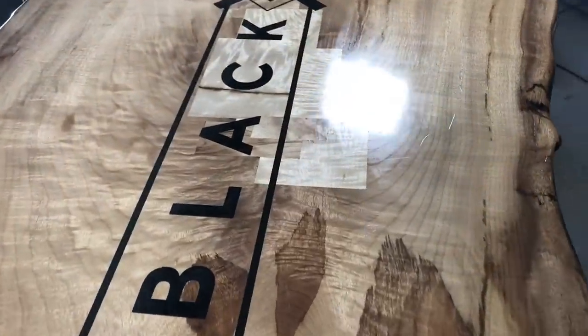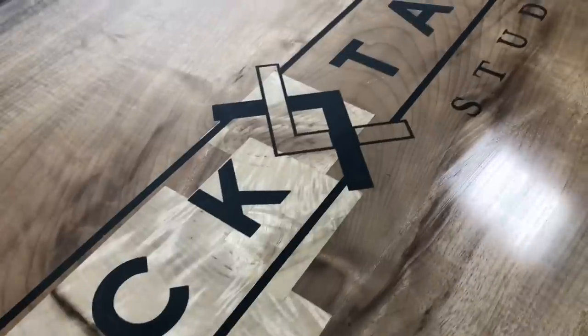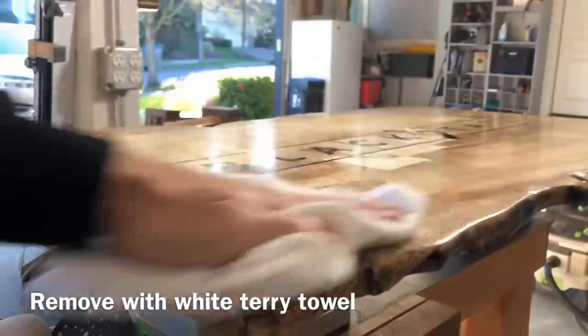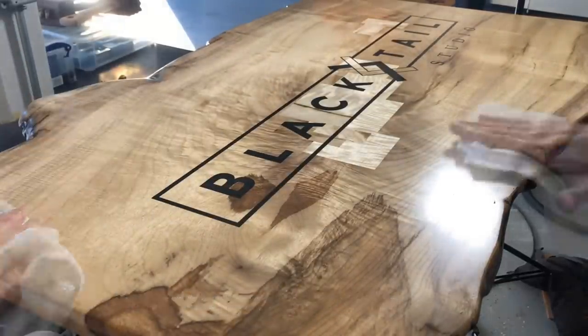Normally, Odie's oil is applied with a white scotch pad, but I didn't want to scuff up my perfectly shined surface, so I just applied it with my hands and rubber gloves. I don't know if that's actually the recommended method, but I let it sit on there for about an hour, and then I came back with cotton rags. You only want to use cotton rags when removing the Odie's oil — go with the grain.